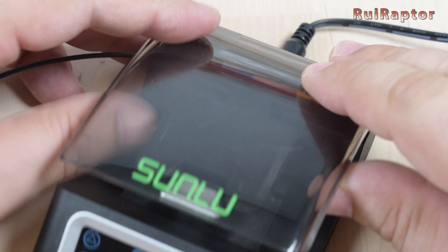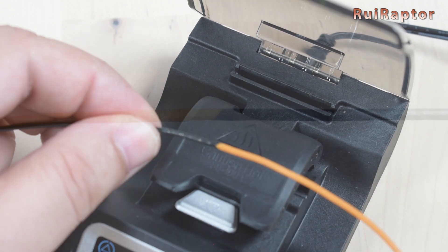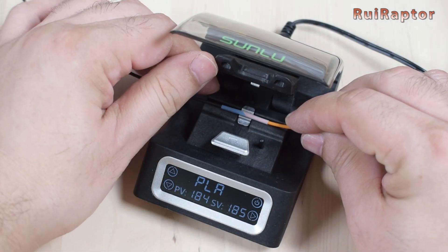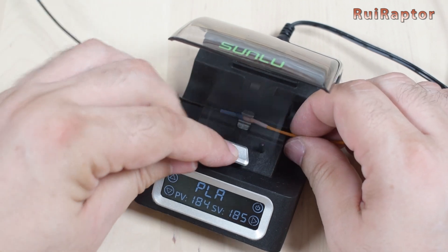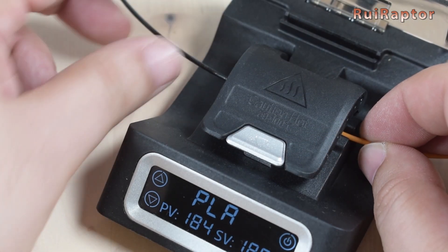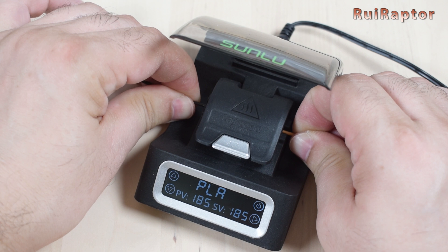Closing the main cover will push the PTFE sleeve against a small blade, making a small cut on it. This cut allows the PTFE tube to be removed easily — and it's done, the process is complete. However, although the process is simple, it doesn't mean the result will be perfect every time. It took a few tries to get an acceptable result. If during bonding you push the filament too much, there will be excessive plastic buildup that the sleeve cannot contain. If you push too little, the filament won't bond entirely and will break afterwards. The right pushing force can only be reached through practice.